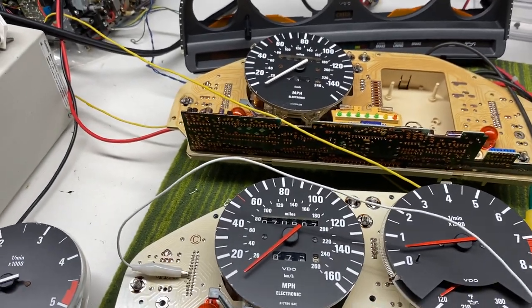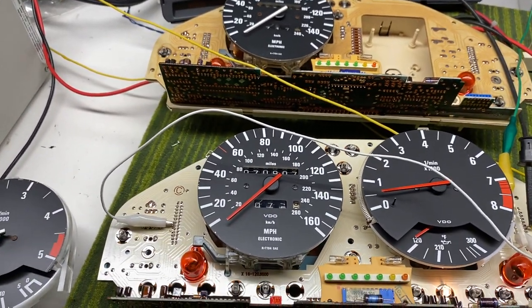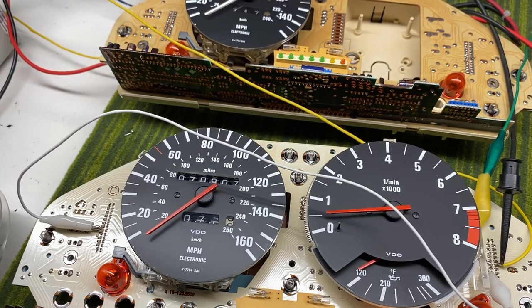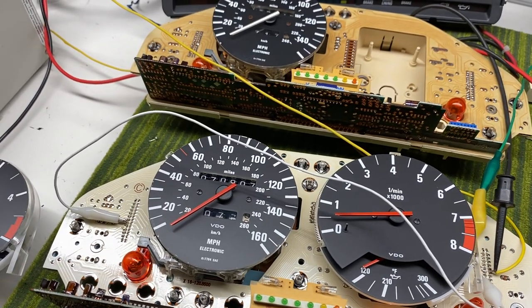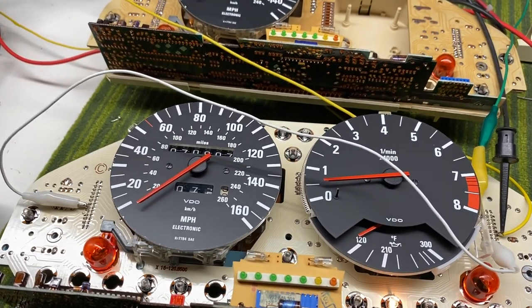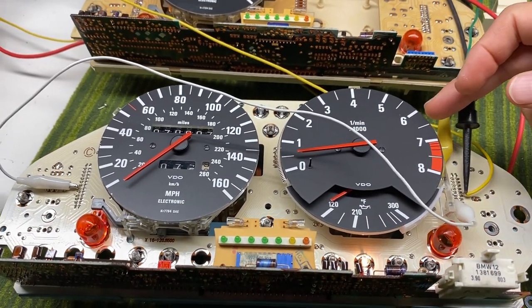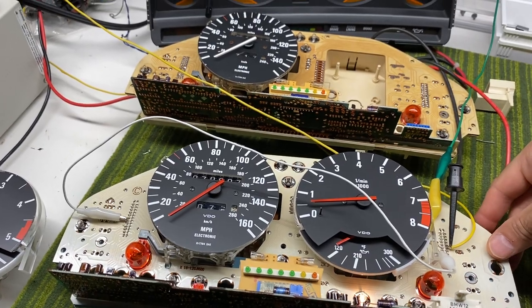The symptom is simple. The M3 came in and the first thing I noticed is that at idle — which tends to be somewhere between 500 and 1000 RPM — the tachometer was registering zero RPM, which is obviously a symptom of something amiss. I did notice that as I revved through the gears it wasn't registering high enough. I'm pretty sure I was near redline and the tach was only showing five or six thousand RPM. I suspect the shop that sold me the car had sent it out a couple of times to try to solve the issue and just wasn't successful at fixing it.